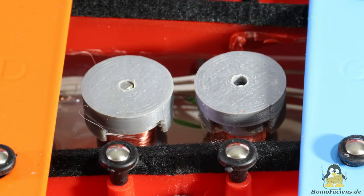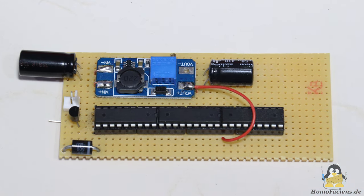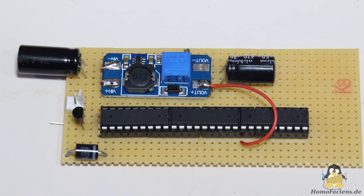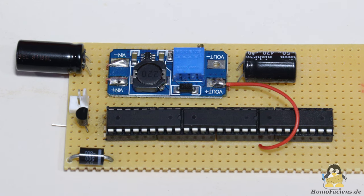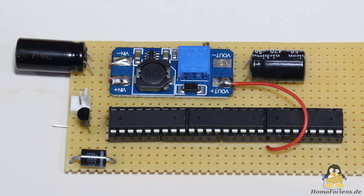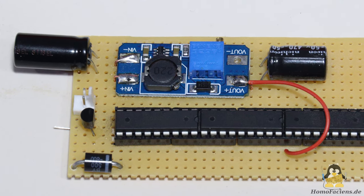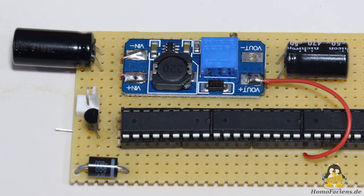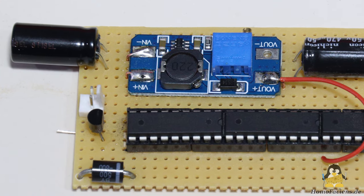A guide on top of the electromagnet ensures that the beaters do not tilt. The coils are controlled via ULN2803 chips, which amplify the signals from the GPIOs of the Arduino Mega. Since 8 electromagnets can be driven per chip but a total of 25 channels is required, I use a small signal MOSFET to drive the remaining 25th coil. A step-up converter is used to boost the coil voltage up to 30V, which increases the strength of the tone.